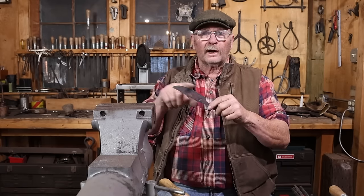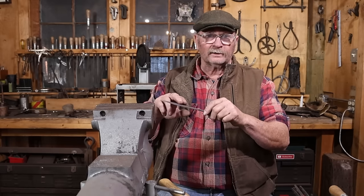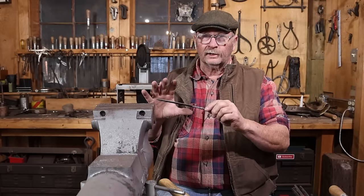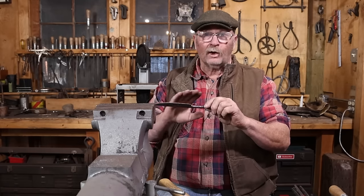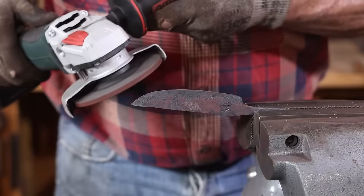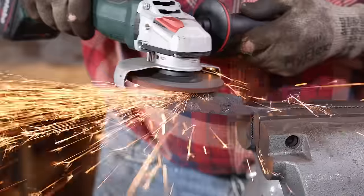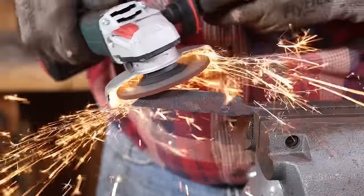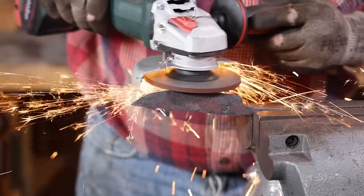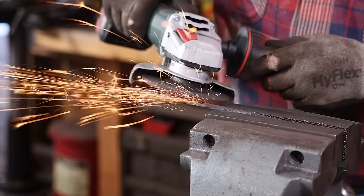I've had pretty good luck with file knives in the past and you see historic examples of file knives, so it is something that works — but be aware there is a greater risk it might break because all of those file teeth are places that could create stress in the blade. So the first thing I want to do is go ahead and grind the profile. As we get to grinding the flats, I want to leave the file teeth and the hammer marks. I want this to be a fairly primitive or rustic looking knife, so I don't want to ruin that forged finish. I'm going to do the initial grinding with a hard wheel so I can get through the scale and my other abrasives will last longer.